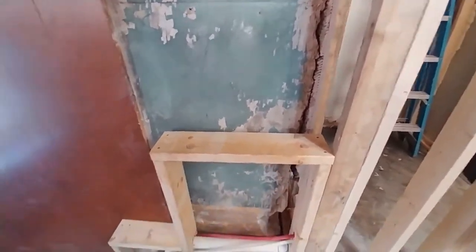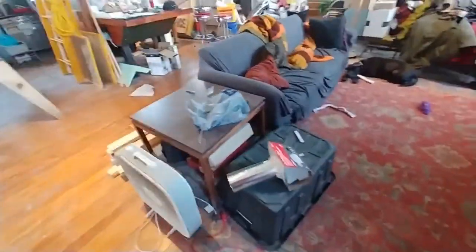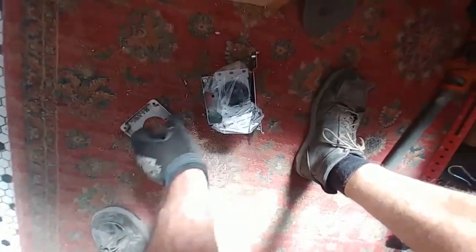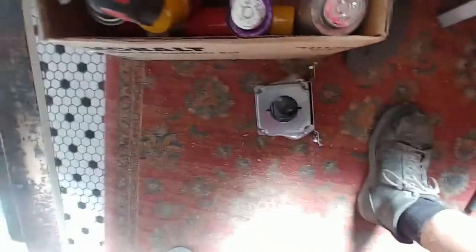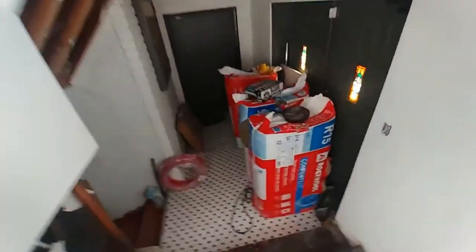So now it just needs power. I got a whip for the machine itself. It's 4-pin dryer cord because it didn't come with anything on it. And then we've got a recess. Well, we got a job box here and a recess outlet and a cover. So that'll be showing out of the wall. Oh, and then downstairs you saw where the water and stuff came from.